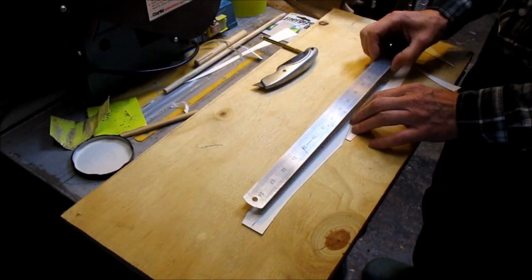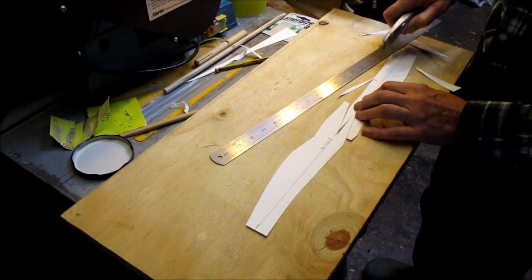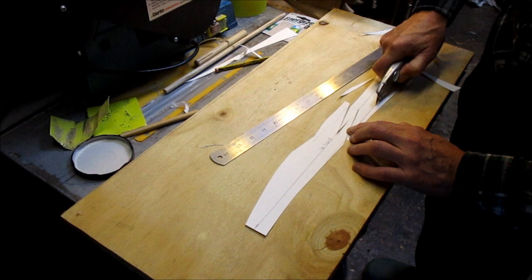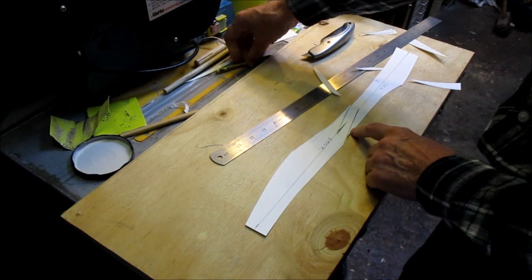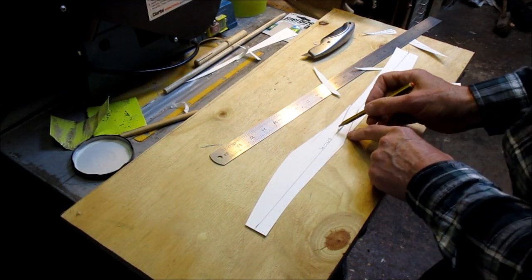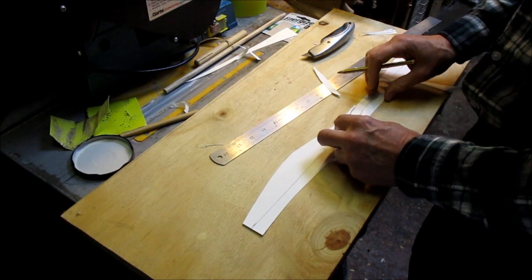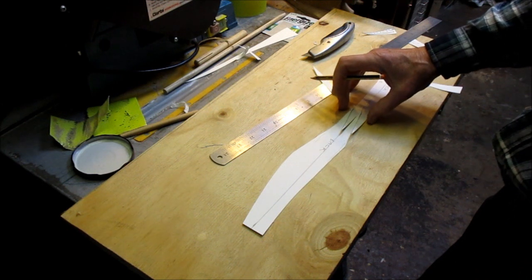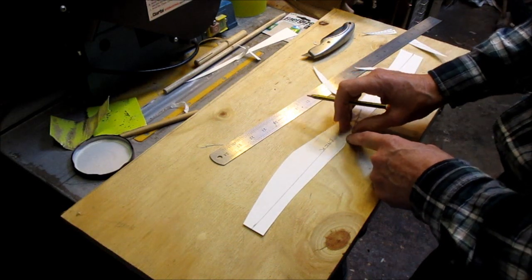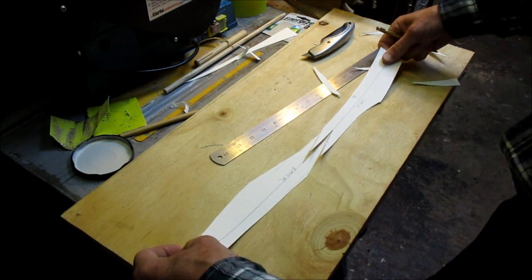And now what? If we trim the sides of the bow, if we trim it off to the 13mm that I said in the first place, see, that's quite a good illustration. You can see when you're cutting it on the bandsaw or whatever, or even by hand, it's handy to have a bit of extra width. But the nice thing is, when you come to actually glue it, if you get it down a bit closer to correct width, a G-clamp across there and a G-clamp across there can clamp it all together nicely. So there you are. Well, that's the theory of doing your Zed Splice.